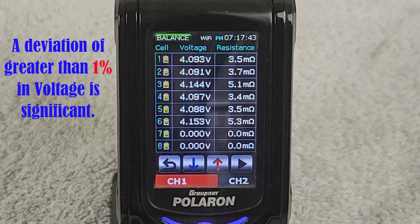The next value we can check is voltage. Voltage is a pretty good indicator — it allows us to check the balance between cells to make certain all cells are roughly in the same condition. The best way to do that is to simply charge your battery pack up and monitor the voltages of each cell as you charge. If you notice that cell voltages are deviating by more than a few percent, stop the charge, then balance out the pack so all voltages equalize.